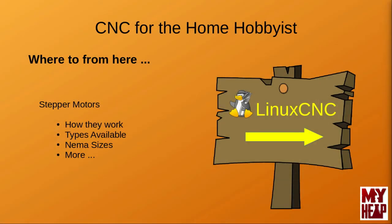We've covered a fair amount of territory if you've been following along with this series. We've located a computer to use for the LinuxCNC controller, installed the OS and LinuxCNC, done updates, stress tested the machine, learned about different I/O options that are available, and installed an additional parallel port card and discovered its resources. In the next video, I want to discuss stepper motors — what they are, how they operate, and the different types available. In the meantime, if you've added additional parallel ports to your controller, be sure to note down the resources they use, both the base address and the enumerated port number.